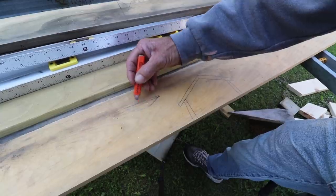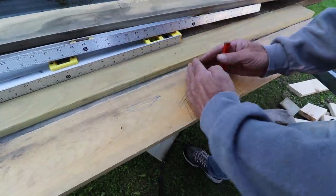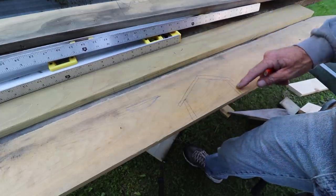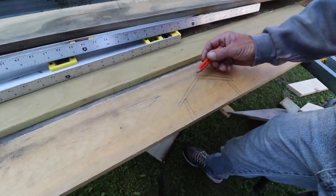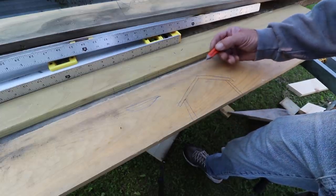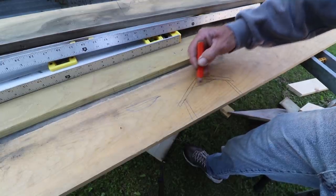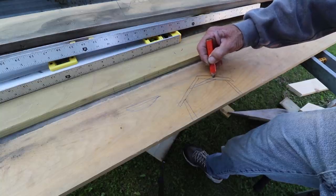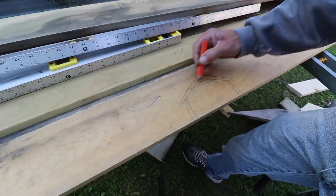If there's a snow load, eventually it would break. And to do that, it would have to push down like this, which would push the wall out, which isn't going to happen in the front, isn't going to happen in the back, because this will all be sheeted. And you really don't have to worry about it too much with such a short roof. This is only about 12 feet out. But by putting a collar tie in here, which back before they had pre-manufactured trusses, if you go up in a roof in an older house, you'll see these all over the place.